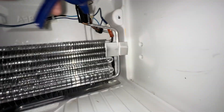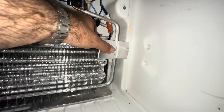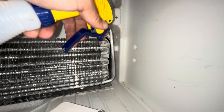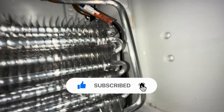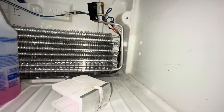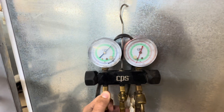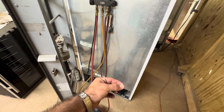I feel like some of those ghost hunting dudes — but with actual freon floating around, not spirit orbs or anything. Watch me not be able to find it. Y'all see any bubbles yet? It is leaking down pretty fast too. Seems like we would be able to find it — I might go ahead and bypass the walls, cut there and there, solder them up, pump it back up.